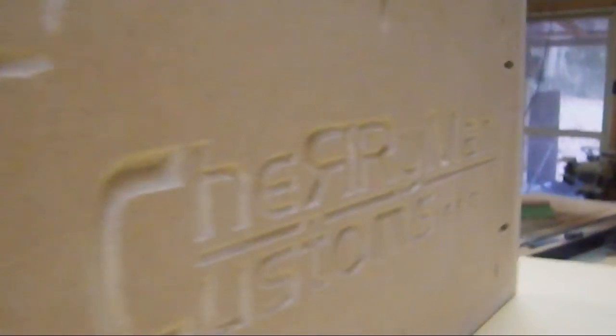Here's the actual wall itself — you can see how thick it is. Everything is doubled up MDF everywhere, so these window braces are an inch and a half thick. You can see the join lines — every line is overlapped. The first box was built through here, and there's the join line where those two meet. When the second outer skin was put on, the join lines are up here. So even if you had the slightest crack anywhere through any of the join lines, it's completely covered up by the staggered outer skin — done on every joint, so it's air tight.